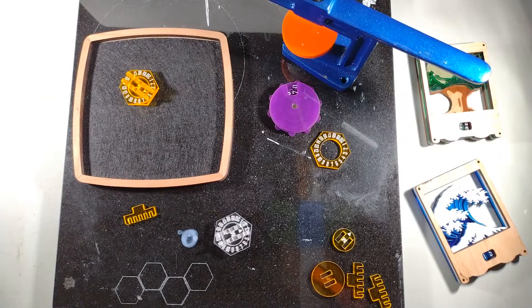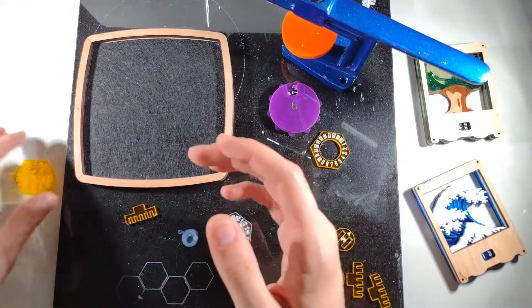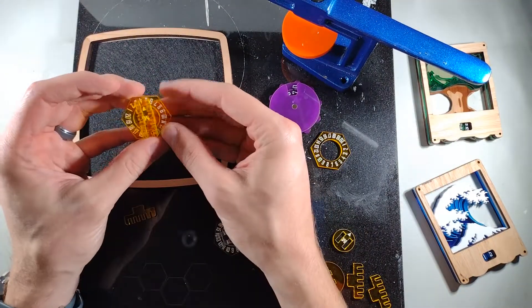So that's a summary of how you can use thickness changes and tolerances to get things to press together without glue, or to keep your pieces working over their lifespan. Something like a cardboard piece, as it wears out, is still going to fit in this slot just because of how it's angled and can change over its life.